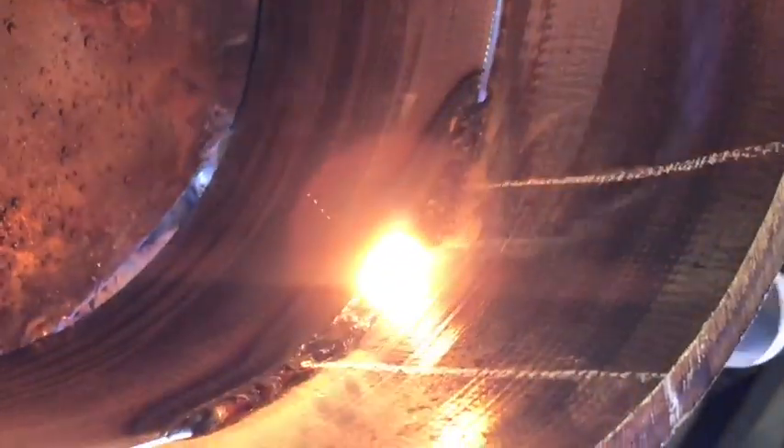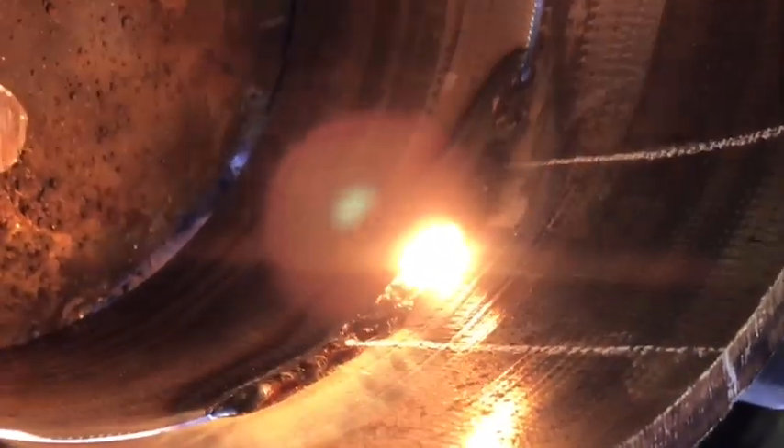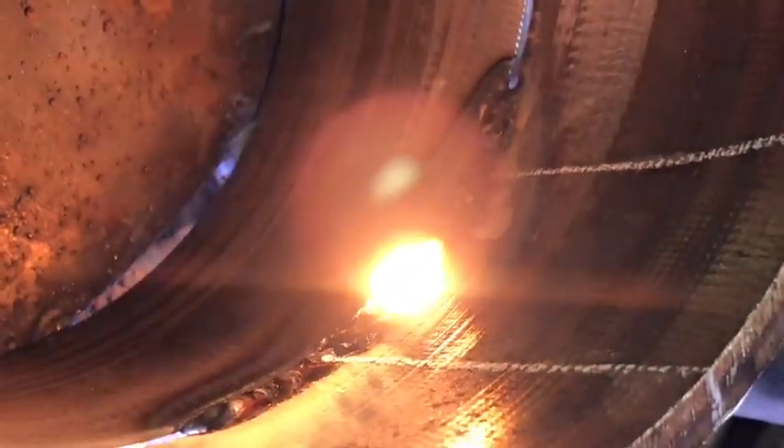Here's what the tungsten is gonna look like. We don't lay it real far back — we just try to do a real blunted tip, a steeper angle like a 60-degree angle, and that helps with your volts and you're pushing more penetration.